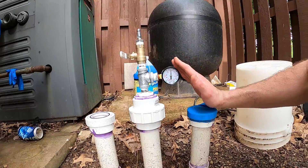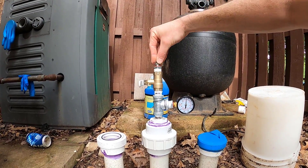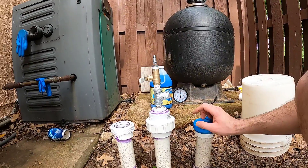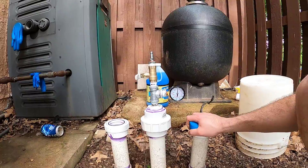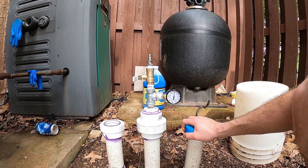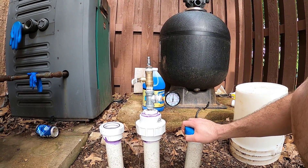The purpose of this video is to show the manifold I've constructed and how I've attached it to the pool plumbing. I don't have the compressor over here right now since it's loud, but the air compressor hose coupling attaches here, and I open the ball valve to let air into the system. Closing the valve caps it off to maintain pressure. I hope you found this useful — check the description for links to other resources. Feel free to check out my channel for the rest of this DIY renovation project, which includes new skimmers, new travertine decking, plumbing overhaul, and new equipment pad equipment.